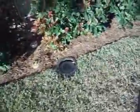Now the grade at the, where are we now? Because we're in an apartment complex, it's not so easy to do left and right elevations. We're going to assume the front is the front door, and everything's going to be left or right of that. So we're on the right elevation, and the grade is a little bit too high. It's going to come into contact with the brickwork, allow damp to get into the building, so it needs to be raked.